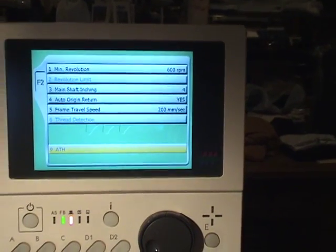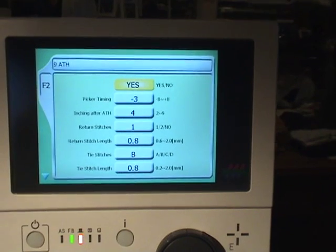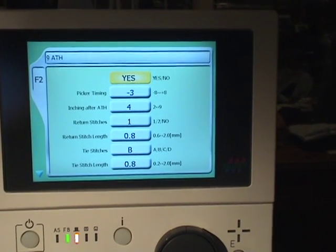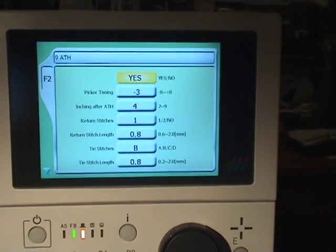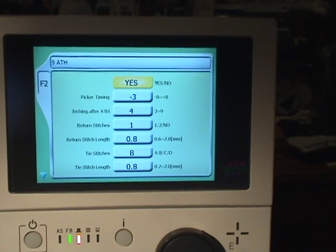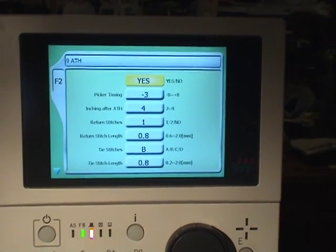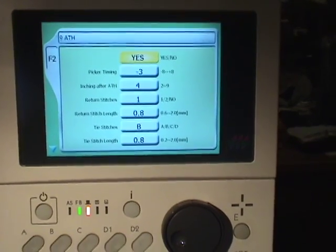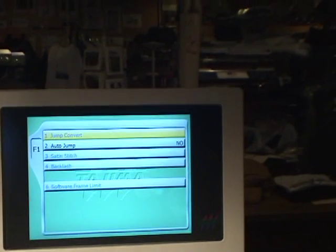Go down to line 9, press set, and take note of the picker timing on this particular model. It's at minus 3. That is the length of the trim setting. When you load the firmware, it does change some parameters back to a default setting. So you may want to go through some of these other F1 keys,